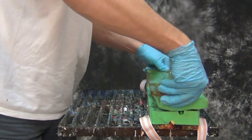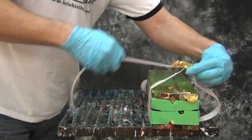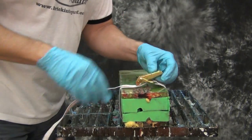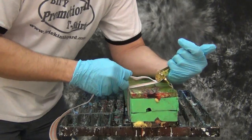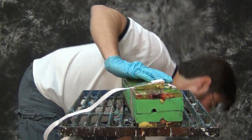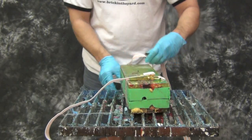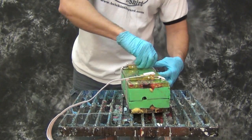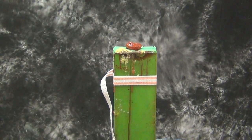Closing the mold quickly is critical — if it starts to expand too much, you could wind up with a really wide seam. Close the mold and immediately attach the tension straps. Then roll the mold over to the other side, kind of like those waffle makers you find in hotels. When you flip the mold over and the foam starts expanding on the opposite side, it helps the skin develop on both sides. Once tension straps are in place, carefully tilt the mold upright so it can vent out the top and allow the foam to expand undisturbed.